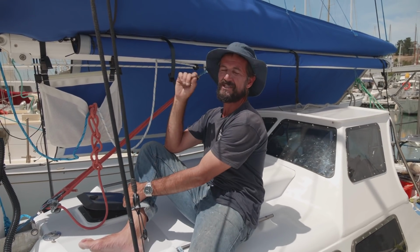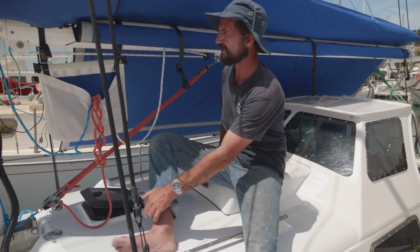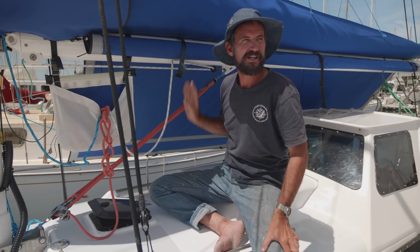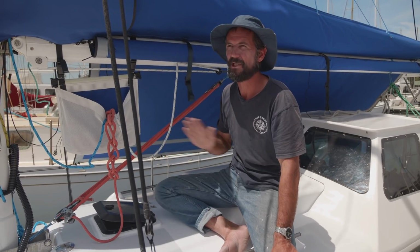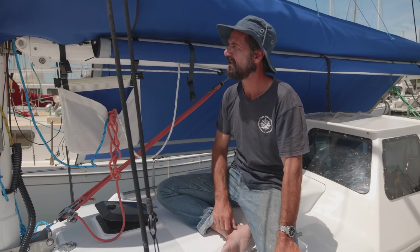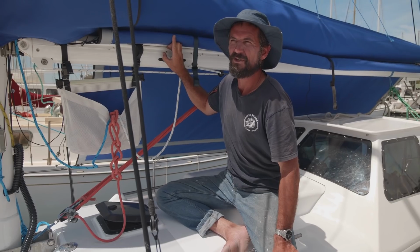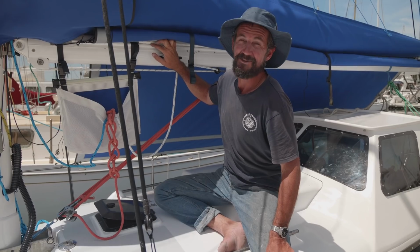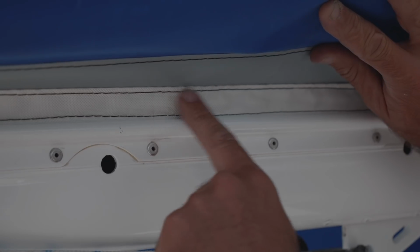One of the things that we really particularly like is this awning. So when we got the boom, it came with this sail track here. And I drilled all the old rivets out and I had a look behind there. It was in pretty good condition. When Scott had this boom, he quite liberally used a lot of lanolin grease on it, so it was in good nick. But back there was a bit ratty, and I didn't know what to do to fill all those holes. So what we settled on was to put the sail track back, and then we spoke to the sail maker and we just asked him to make an awning that's got a bolt rope that fits this track.